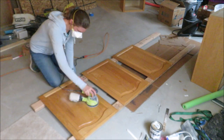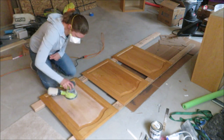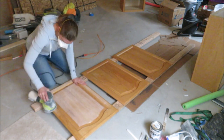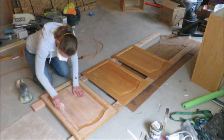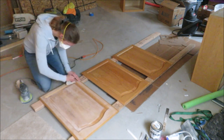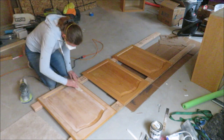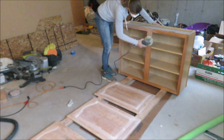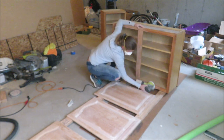Painting your cabinets is a very long, tedious, detailed process. I joined a professional group of cabinet painters where I learned a lot. I used my orbital sander with 220 grit sandpaper on all the flat surfaces, then went in with a sanding block to get all the ridges. These cabinets were such a pain to sand because of all the ridges and grooves. Make sure you're wearing a proper dust mask. I did the cabinet doors and the cabinet boxes — I only had three doors and two cabinet boxes, but it still took quite a while.